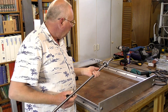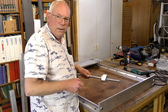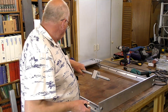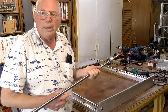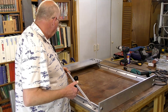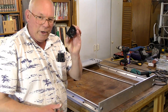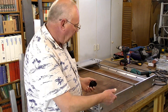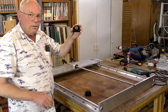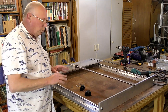I was going to have this out on the front with no bearing at all on the back, and just put the stepper motor directly on the end of this shaft in reverse. It turns out I can't do that, but as it happens my measurements work out perfectly to go the proper way — dual bearing at the back where the stepper motor will be, and a single bearing at the front.